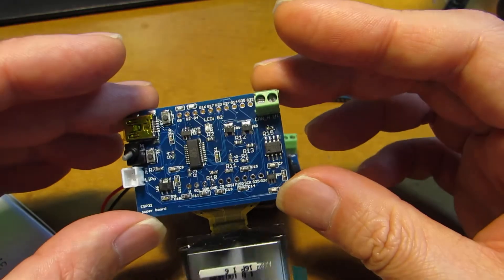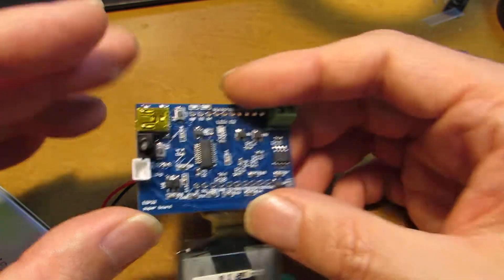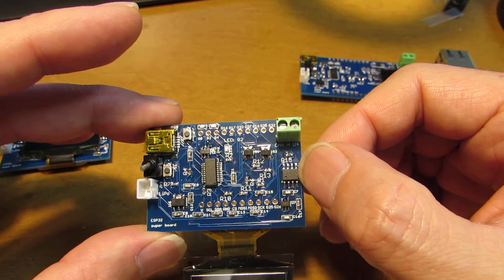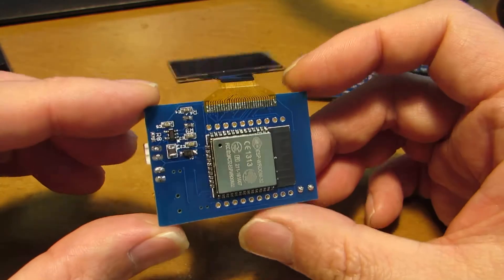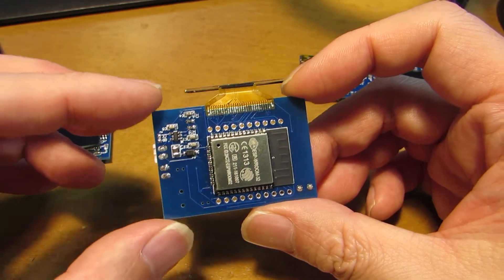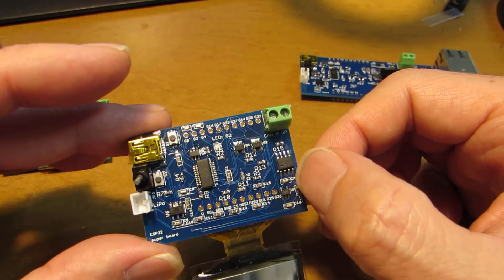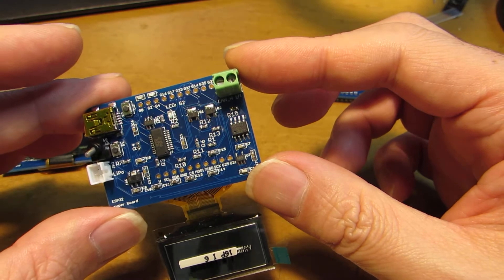There is one small difficulty: the lithium polymer battery produces 3.7V, but the CAN transceiver and CAN interface require 5V, slightly higher. So on my board I put a voltage booster. This booster part generates more than 5V, and 5V is then regulated by LDO drop regulators around here. The regulated 5V is applied to the CAN interface — it's a Microchip MCP2551 or something similar.